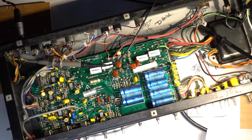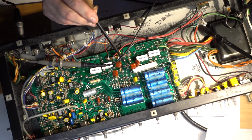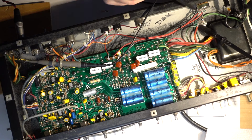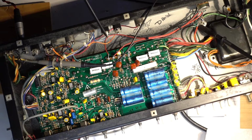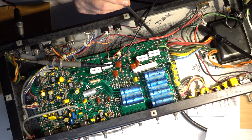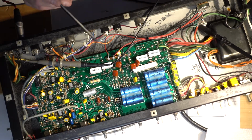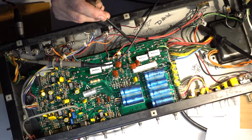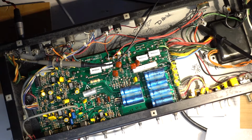So I think this amplifier has a problem with the modification that was made. You see this bunch of these wires and caps there. It's a master volume on this part, post phase inverter master volume. It's a usual modification that you can reduce the master volume and still get distortion from phase splitter. It's nice, but I suspect that this bunch of wires causes the oscillation, and if I unplug the speaker it starts self-oscillating.